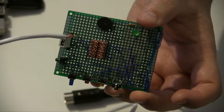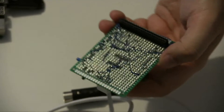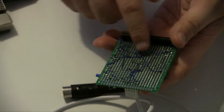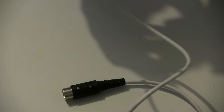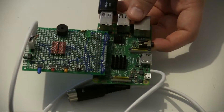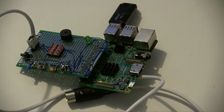You've got to be very careful with wiring. You can see quite a lot of bodge wires, and most of those bodge wires wouldn't exist if I didn't have the buzzer, the light, and all these switches — I'll explain the switches a little later. Now I didn't do this right: I accidentally inversed the header, so when mine connects to the Raspberry Pi I had to cut off a bigger header, leaving a rather ugly bit without pins that you've got to make sure you don't accidentally insert. So yeah, mine doesn't look how I designed it, but it still works, so it's fine.